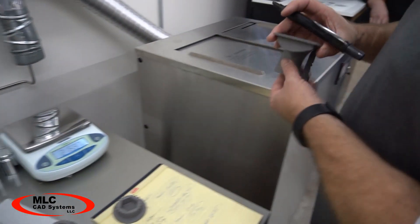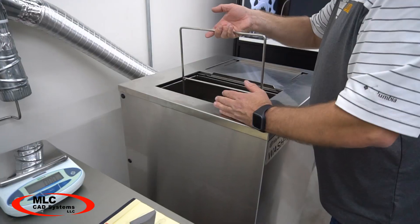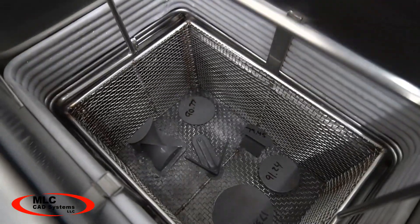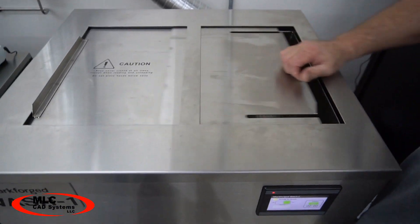The next step involves a wash cycle which uses an industrial degreaser to remove some of the binding agent. Each part is carefully weighed before and after the wash, and by measuring the weight loss you can make sure the process has been completed successfully for the next step. The wash also has a built-in drying compartment, a recapture and ventilation system so the entire thing is fully contained and there's no fumes.